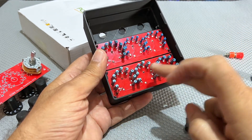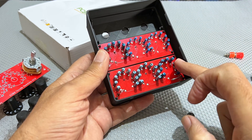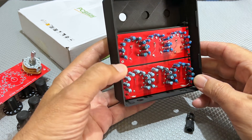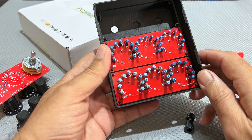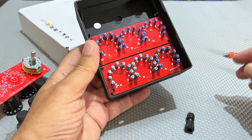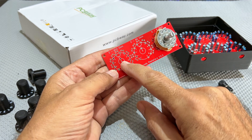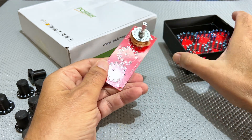Alright, one step further — this is the first row, second row; the last one I haven't put in yet. But these are the 1 ohm, 10 ohm, 100 ohm; this is 1k, 10k, 100k. These resistors are all 1 watt although some of them do seem smaller, which is a little bit strange, but they are indeed 1 watt. On the bill of materials I've got the actual Mouser references. I do have the 10 meg, and I've actually found 100 meg resistors which are on order — when they arrive I'll probably populate this just to make it complete.